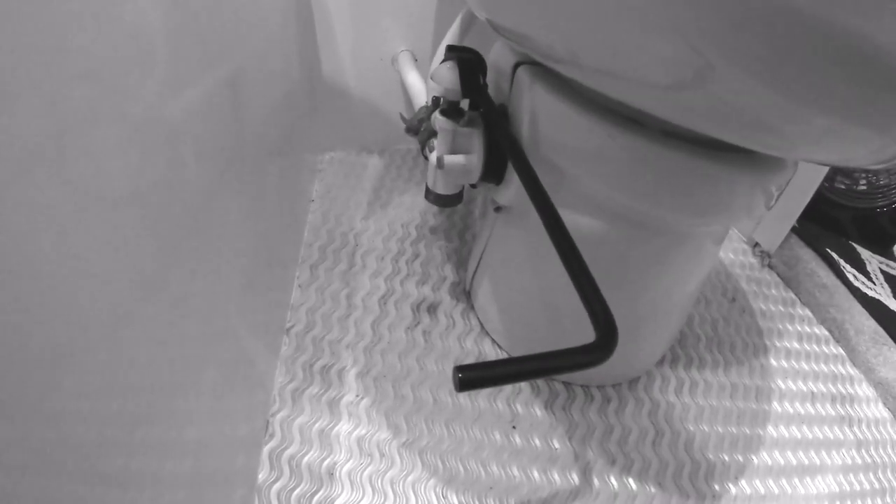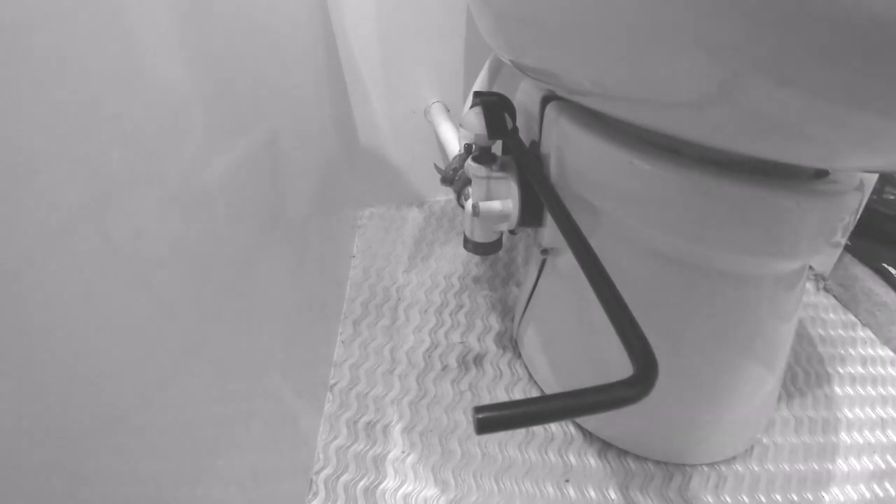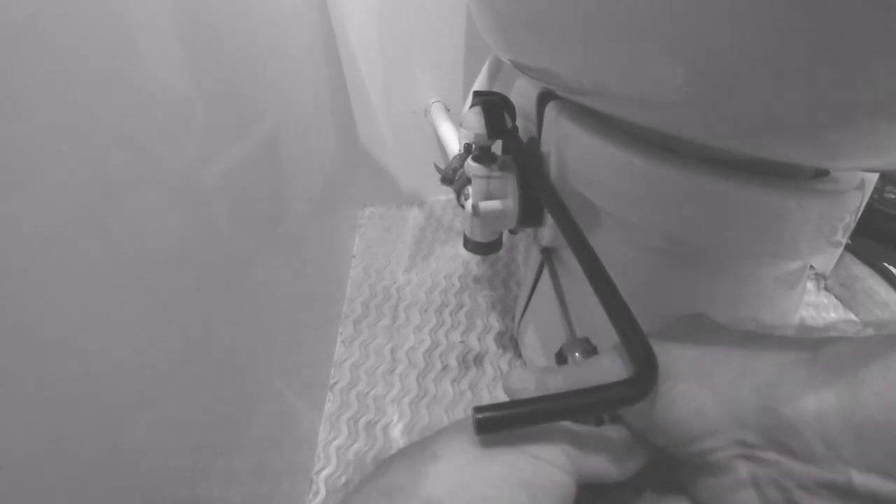Step zero was to cut off the water — you can see there's no water pressure coming through. That little plastic cover sits on top of that. Now we're moving on to the next step: taking off this cosmetic cover, then we'll start detaching the bowl. Some models just rotate off, but this one has one screw holding it. We're going to carefully take that out with a number two Phillips, noting how it goes back on.